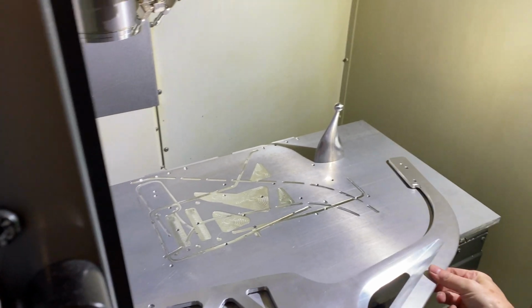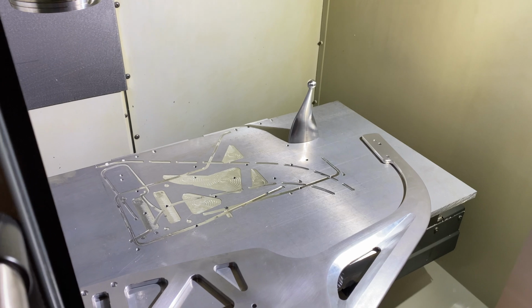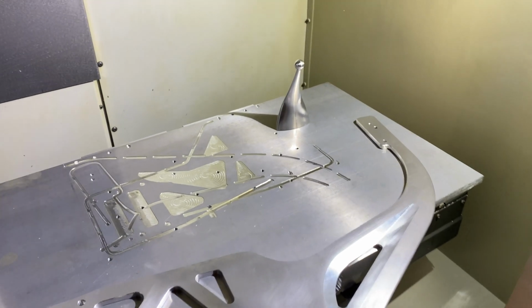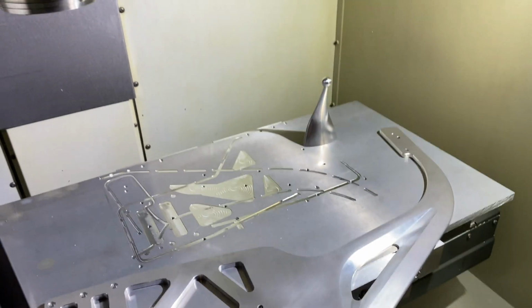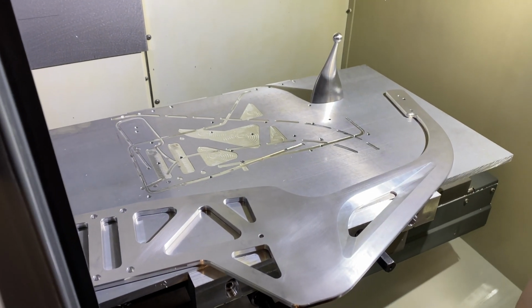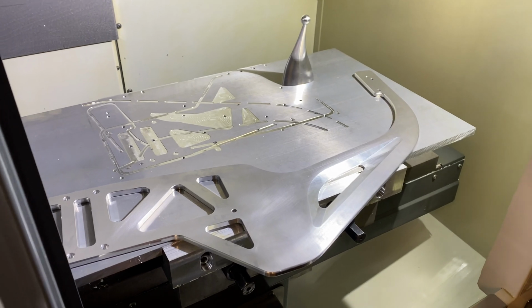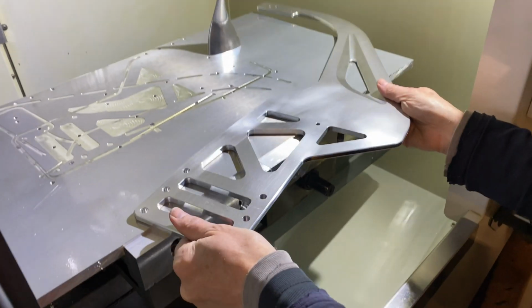And for those of you that don't know anything about CNC cutting, and I didn't really know this before I talked to Lee, basically, you have to clamp the part down so securely because there's so many forces going through the actual cutter, so there can't be any movement, otherwise you will get mistakes on the part. So yeah, it's quite a process. I don't think there is on this one, but I mean, you can see the finish is pretty good.